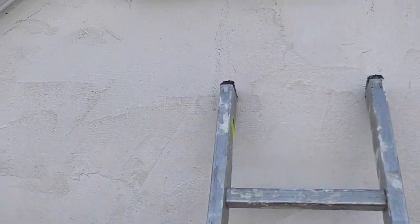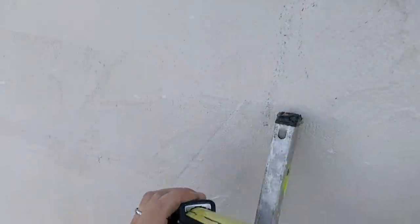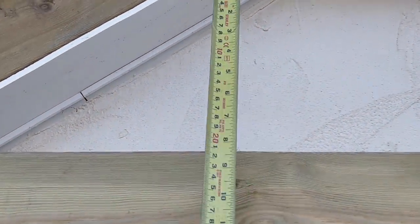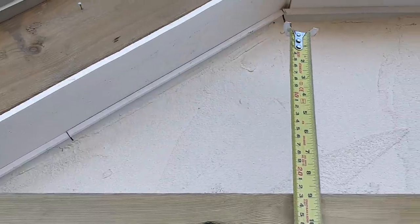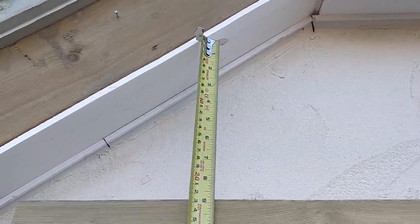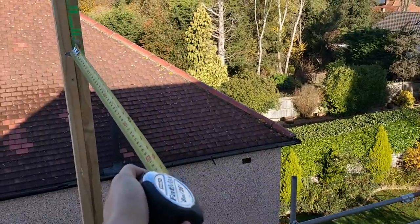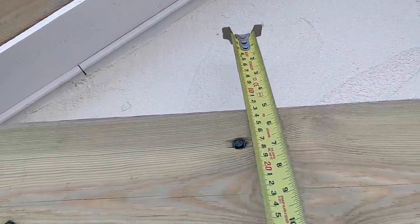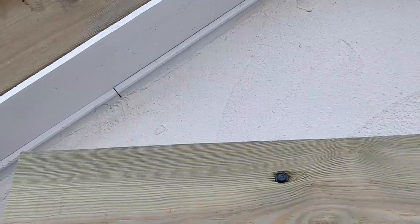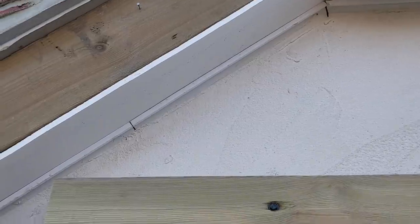And actually this helps me not cheat, but just get a little bit closer without having to worry about the maths quite so much. I know that my ridge plate is going to be 223mm. So I can sit that at 223mm and slide it along this way until it hits the bottom of that rafter, and then I know it's going to be perfectly square and in line, because that's the middle of the house. That should stop my ridge plate from being skewed at an angle, hopefully. That's the plan anyway. This takes a little bit of the guesswork out of it, and it's never going to be seen. It's going to be inside the roof, underneath. So it just helps with that.